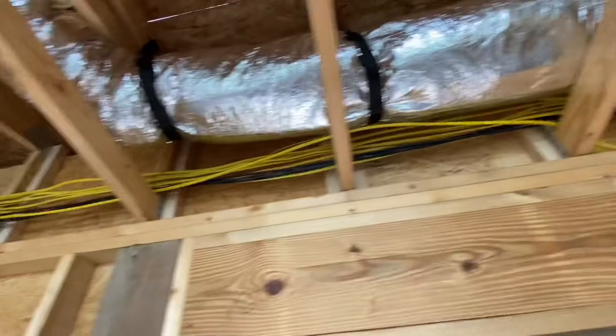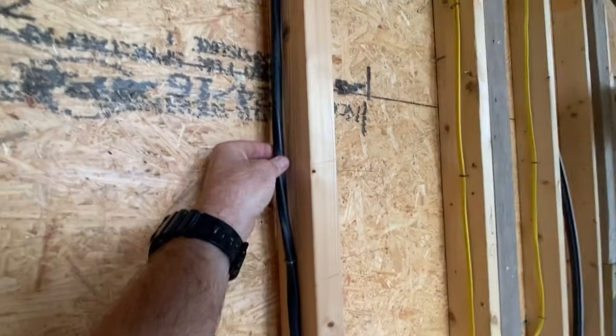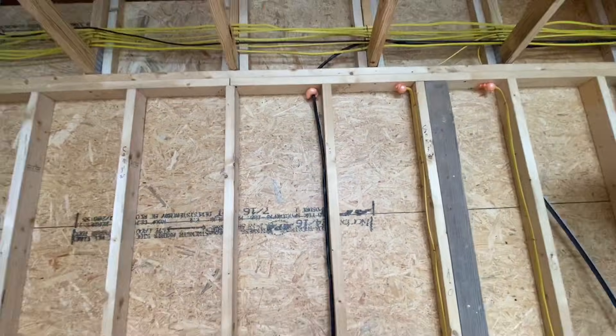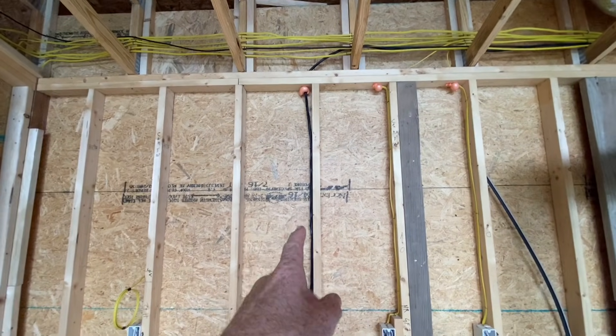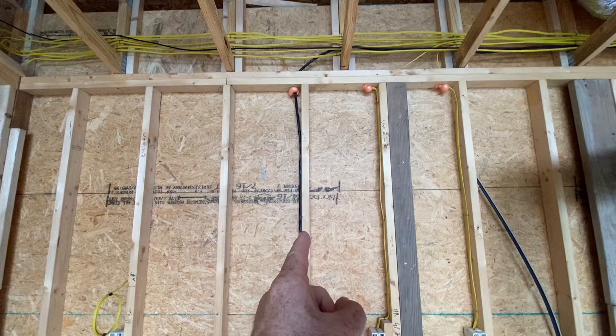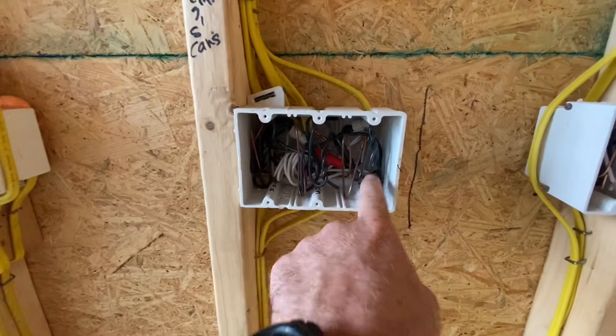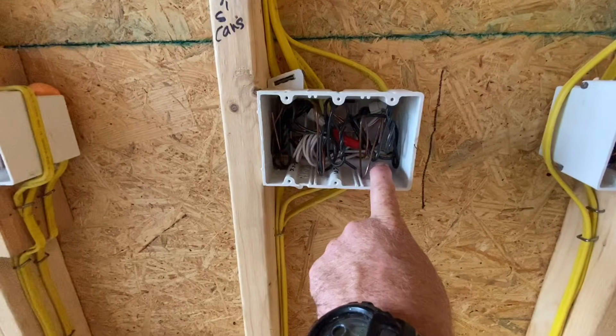Let's follow these home run wires — you can see they're bundled pretty closely together, running through the house to different circuits. Let's follow this black, really heavy-duty-looking one right there. It travels down to right here — and that's where the stove will plug in. That's a heavier-duty wire than most of the circuits in the house because the stove pulls a lot of power. Each wire has to be sized for the circuit or the appliance it's going to be running, so that it doesn't trip the breaker or catch the wire on fire. Some of the home runs just run down the wall into a switch box, and that will power all the lights on this circuit. One of those legs will get tied into each switch so that each switch has a hot leg. I have a video of this whole thing getting tied up — let's watch that, it's pretty interesting.